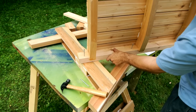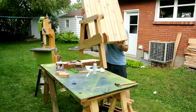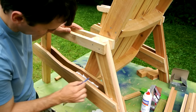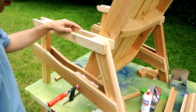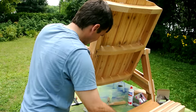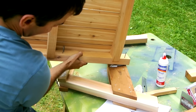This corner should be flush with the bottom edge here, and this on the back corner here. It's important to test fit this on a level surface so that the chair doesn't end up rocking. But I still need to get the glue into those joints before I nail them. Now I just have to line that up with the old nail holes and I'll have perfect alignment.